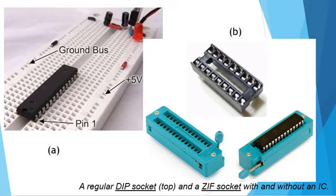Now coming to how to place these ICs on the breadboard and on the DIP socket or the ZIF socket. As you can see in figure A, the IC is placed so that the pins on the left side and the pins on the right side are not short-circuited. That is why when we place the IC on the breadboard, we place it with a spacing between the parallel lines of pins. The dual inline package ICs can also be soldered into the PCB.